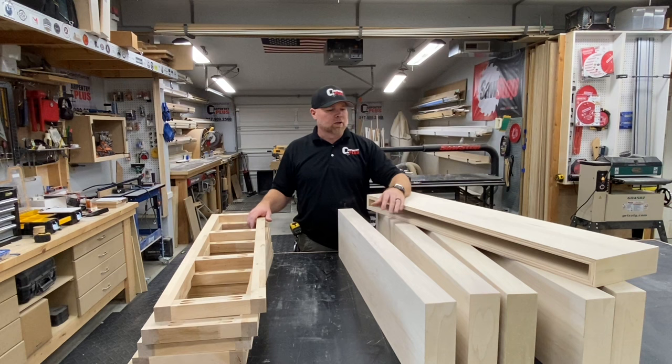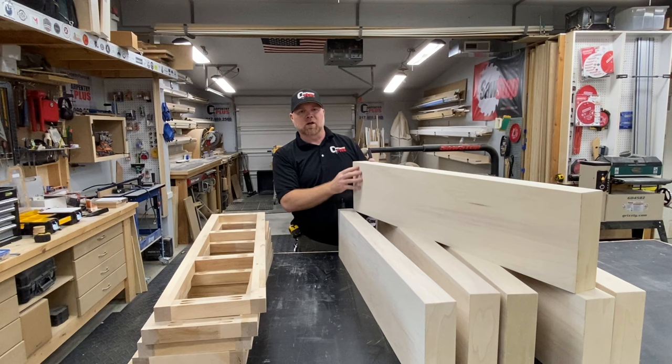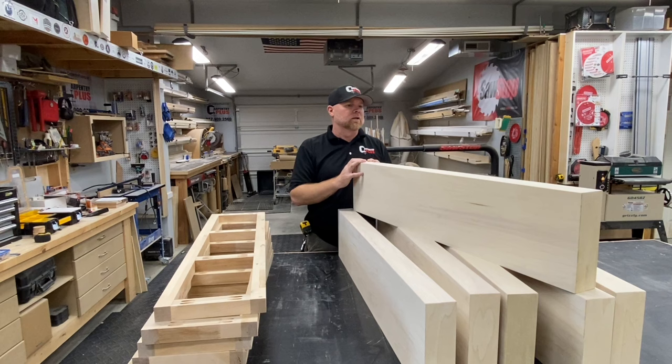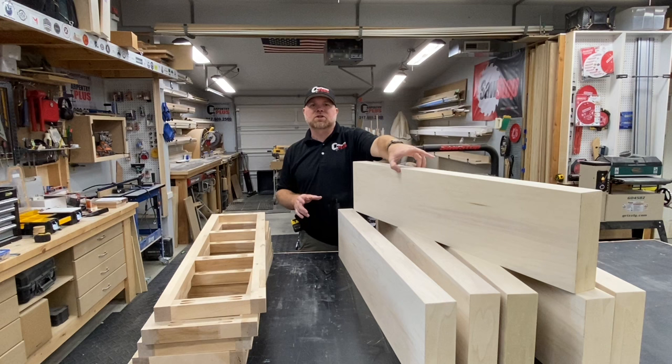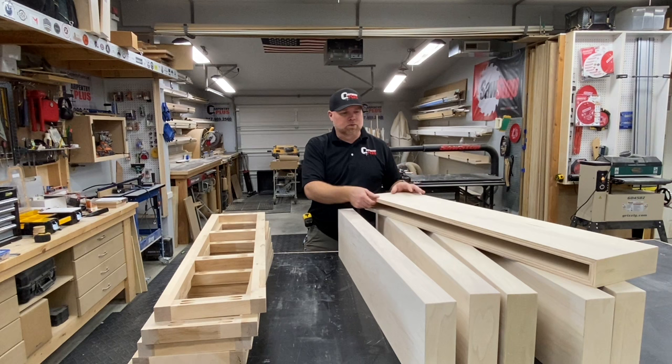So we start off, this particular set is a miterfold shelf, so it's plywood. We've ripped everything to 45s, did our miterfold technique with the tape. We've got videos on that on our channel here, so be sure to check that out for more information there. So we do our shelves at 3 inches thick. So we've got 3/4 inch plywood that gives us a hollow space in here of 1.5 inches. Usually a little bit bigger than 1.5 inches because the plywood's not a full 3/4.